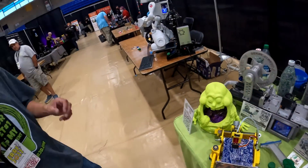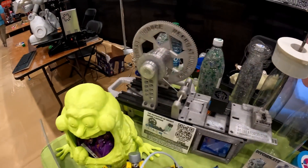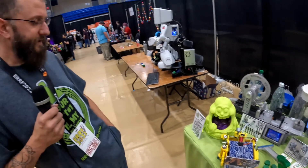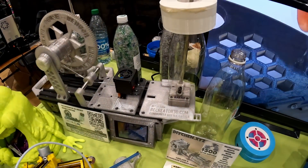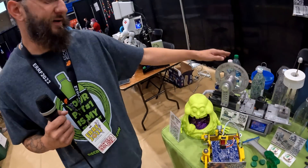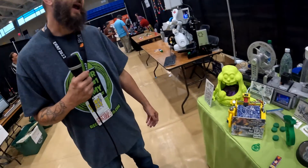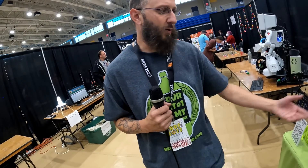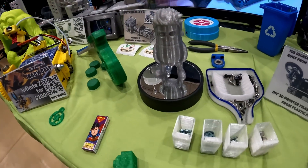So you're taking basically an old Ender 3 style V-wheel bed flinger, taking old plastic bottles, and reusing them to turn them into usable PET filaments. One of the good things about not having the glycol in it: we were originally 3D printing our mounting bracket out of PETG, but we found that the pultrusion process pulled everything forward when melting it. The PET can go up to printing temps of 260, so anything below 255 won't melt it. We're only pulling at 210, so it's a really robust material. We no longer have any stretching or breaking.